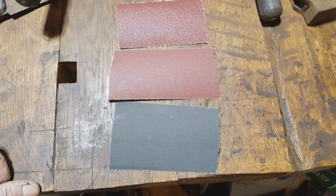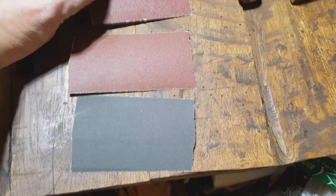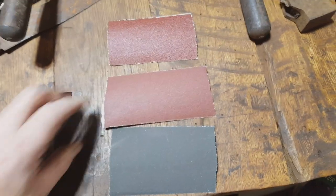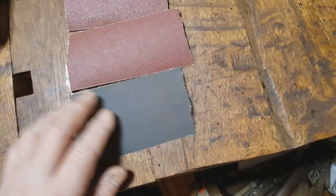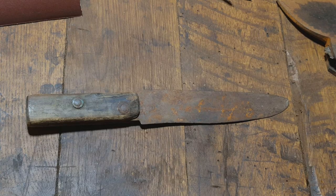A quick talk about the sandpapers I use when working on these tools. This is 100 grit — I buy these in strips from a guy at the flea market. This is 180, and he also sells sheets of 400 wet-dry which I use for both dry and wet sanding. One of the things I do is look at just how crusty something is before deciding what kind of paper to use on it.